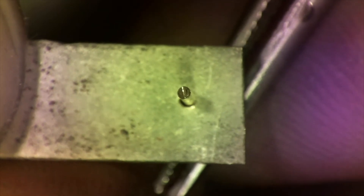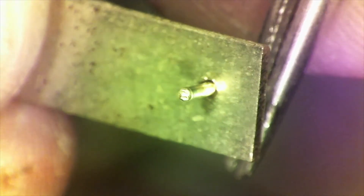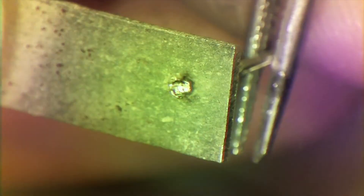After inserting the piece, we'll hit it with the laser a few times to cause the end to ball up. This will give us the requisite fill material to avoid gaps or porosity, while also ensuring that the joined piece does not slip out of place while we're working on it. Once it's tacked into place, increase the laser's power just a bit to assist with weld penetration.